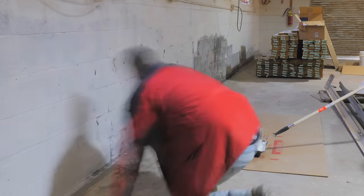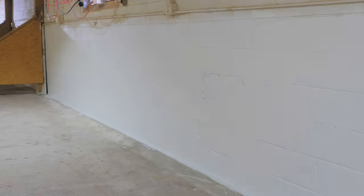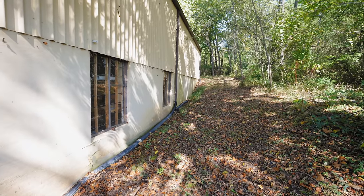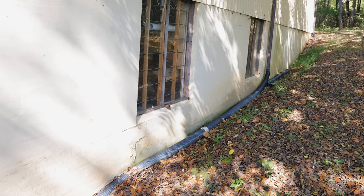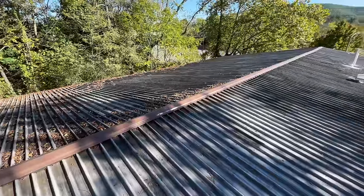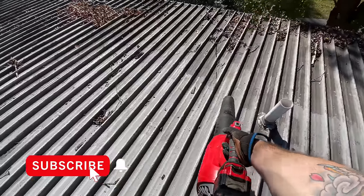We applied a super consistent film of Drylock for the most effective waterproofing, repeating the process for a second and third coat — rolling on the Drylock and then filling any pinholes with a brush. The entire five-gallon bucket was used up on these walls. I should mention that waterproofing the inside is really just phase one, since the most effective approach is on the outside. I've already cleaned the roof and improved the gutters, and the next step will be borrowing an excavator to do some dirt work around the building.